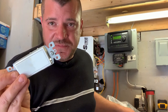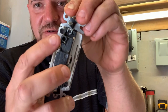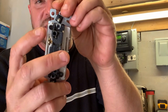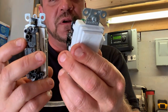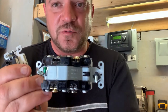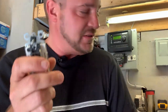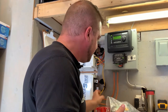Here's a Decora three-way switch. On the back you can see there are three terminals — your common is here, which is your black wire, and then your two travelers here. The travelers run between the three-way switch and the four-way switch. When you look at the back of these switches, you'll see an 'in' and an 'out' — it's important that you bring the two travelers to the 'in' and the other two travelers go out to your next three-way. If you cross these, things won't work correctly.